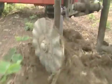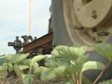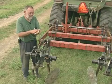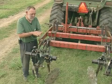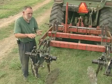This thing goes about 12 to 14 inches deep. The disks just form the ridge right up over the slot. The key to the zone builder — whether it's this one, a commercial one, or whatever you do with zone tillage — the key is to do vertical tillage, not horizontal tillage. We don't want the tool engaging the soil to push it sideways, like a moldboard plow, a disk, or a field cultivator with sweeps, because that's where you get a compacted layer right where that shearing action is from the sideways motion. Everything on this thing, with zone tillage, is a vertical form of tillage — no sideways shearing. That's the key.